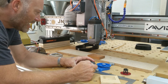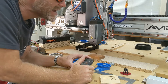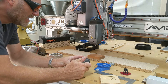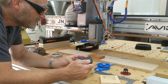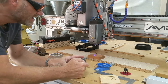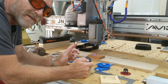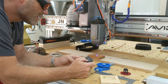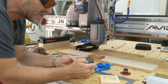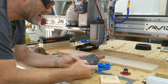Now I'm going to set my X and Y. I've got a small light X in the center there, so I'm going to turn on my laser — the fan's kind of loud, so I'll try to talk louder. With the laser on, I have hot keys on my keypad where I can turn the laser on at a very low power. It's not going to burn anything, but it's still good to have your safety glasses on because it's pretty bright, especially this XT8 — this is a 45-watt laser. I'm Z'd up so the spot is really large, but it doesn't matter. I'm just going to center it on my X there and then turn off the laser.